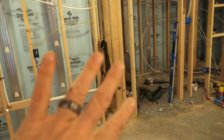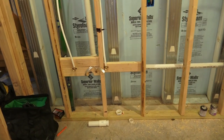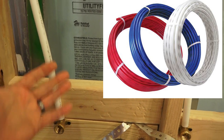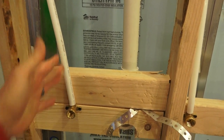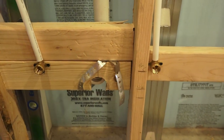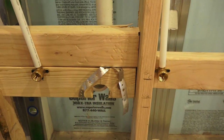In this area directly in front of me, I've got the stairs coming down, and from that stairway wall over to what will become the bathroom door I had this eight-foot section that will be the walk-up bar. The rough-in we have so far: I've got my rough-in PEX, which is the white half-inch PEX line. This also comes in red and blue — you can do cold in blue and hot in red. We buy it in hundred-foot rolls at Home Depot. Hot is on the left and cold is on the right. Hot is wrong, cold is right — that's how we always remember it.